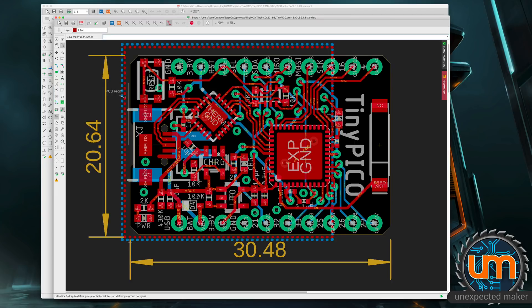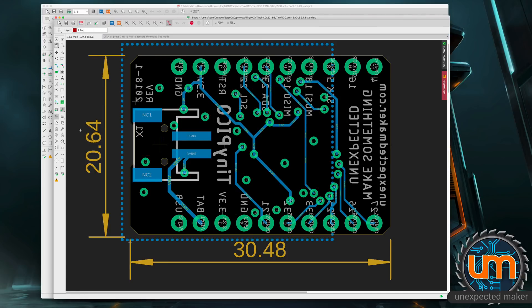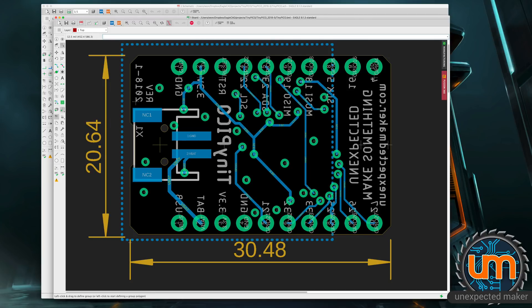Let's have a look at how the board looks now. It's a little bit more detailed. Before I turn off the back layer just to make it cleaner — you can see I've put dimensions on the board. It's just over 20mm by 30mm. The D1 Mini is about 25 by 35 or 36, so it's quite a bit smaller. The only thing on the back of the board is a LiPo connector. The board ships with charge circuitry, and you can still use the battery pin if you want. If you want to connect a LiPo, you can attach an included JST connector — just hand-solder it on.